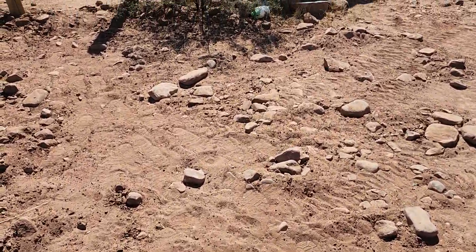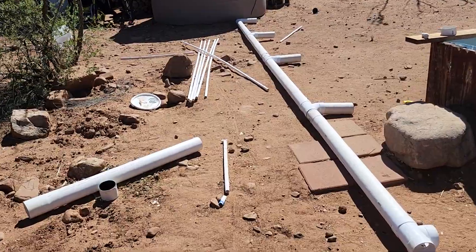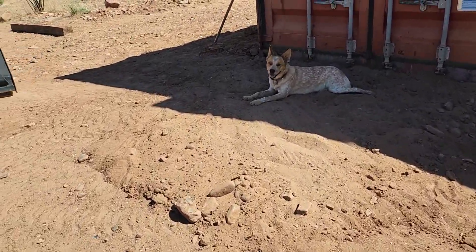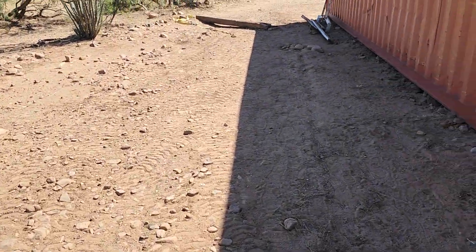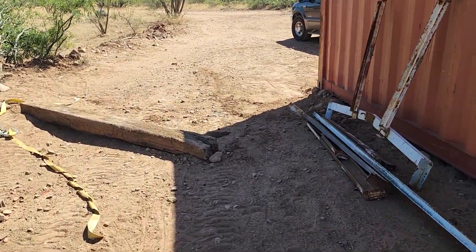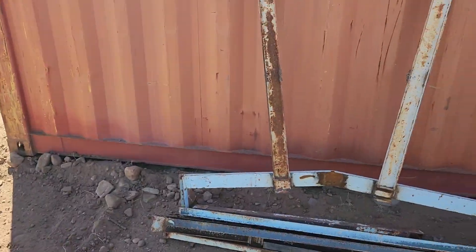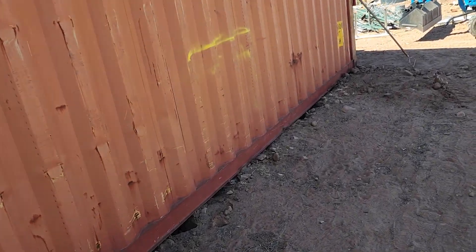It's been a busy day. I fixed the shipping container once and for all — I'm sick of it sinking in the ground. We originally had that thing sitting on railroad ties. I'll show you what happens to the railroad ties, at least it happened to this one. As you can see, it's all crushed right here and breaking apart. So the one side of the shipping container was always sinking — I kept having to jack it up and fill it back in with rocks and shims.